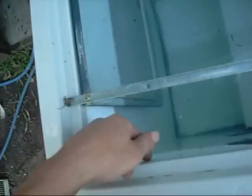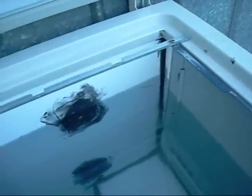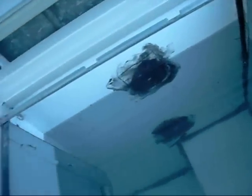They're painted on the inside, so I shouldn't get too much transference to this if there's any scratches in the paint. This inner cabinet's made out of steel as well, and it's probably grounded because the refrigerant lines run around the outside of it. So it will be going to ground. That means it could possibly become part of the circuit and start eating through. So I might end up protecting it by trickling a negative DC charge to it as well as the workpiece. I'll just put a big resistor across it and protect it that way.